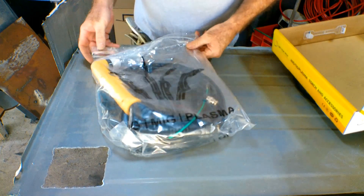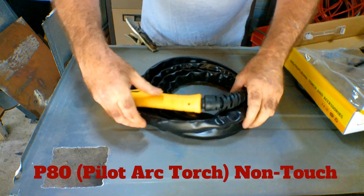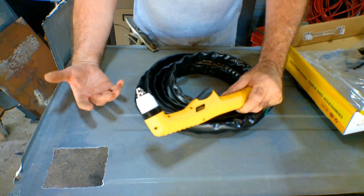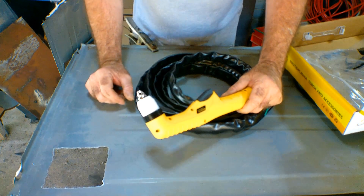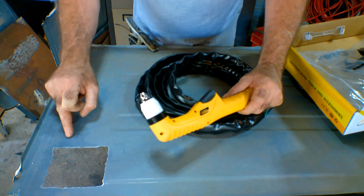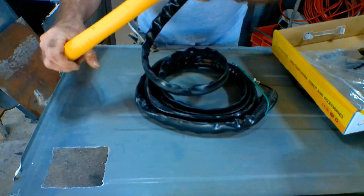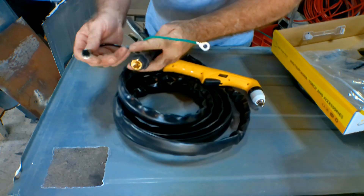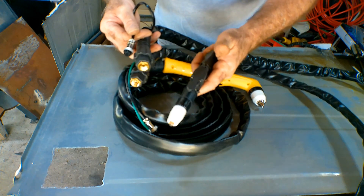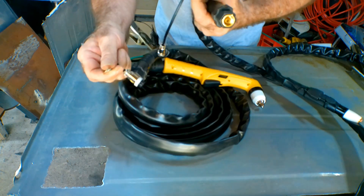If you've got pilot arc and you're only running 50 amp, you might be able to get away with this one. This is a P80 torch — it can run up to 100 amps, but it will run on 50. How well it runs on 50 is debatable; I don't think you get as much life out of your consumables. 60 amp is a lot better. With pilot arc, remember you're above the metal and you need a little gap, otherwise you burn out your consumables if you touch it on the steel. Now see this one has an extra wire — that's for your pilot arc. This is your switch and this is just your air. The non-pilot arc torch only has two fittings: your on/off switch and the air connector.